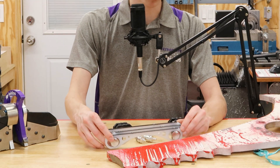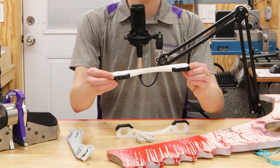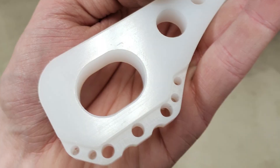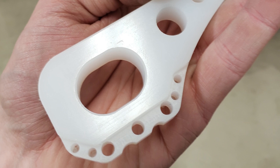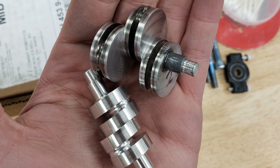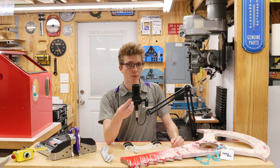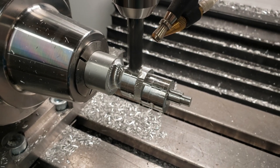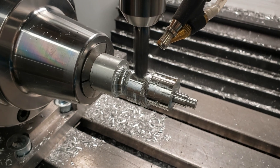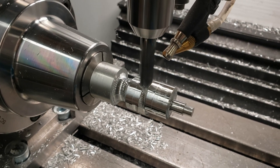During testing, the grip tape feet would want to rip off when we made turns, so at the last minute we had to redesign some new feet with molded urethane on the bottom. To allow ourselves enough geometry for the urethane to bond to, these feet are made of half-inch thick UHMW with 60 shore urethane bonded on the bottom. They are incredibly grippy on the arena floor and were pretty easy to manufacture, but the cams that went with them ended up being very slow. The original cams took about a full day to machine. The new cams are much smaller and only take an hour to machine, but they were too slow to be really effective. With how late it was right before the competition, we had to go with the slower design, but we had extras in case the feet took damage.